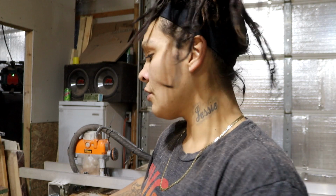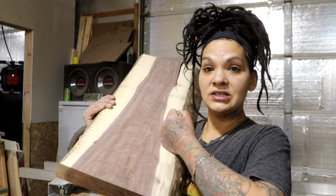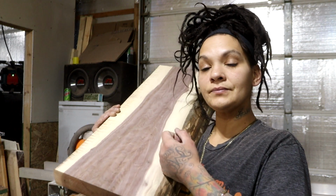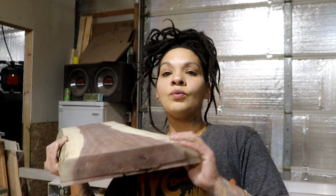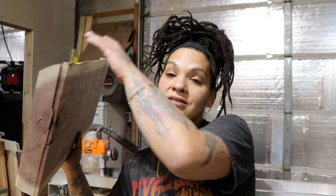So basically what happened is when I first got it, the wood that I bought, when we tested it, I just stuck the moisture reader in and it read 8%. Okay, cool. So what you want to do is check where the core is at. So if you get it cut, check at the core. Most of the time, if they're good, they're going to have something that'll go down into the wood, and you can just check like that.